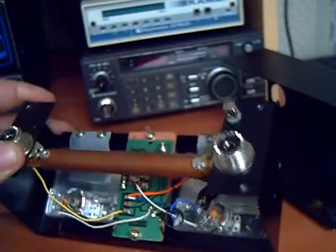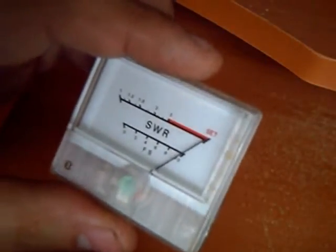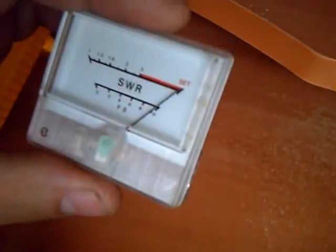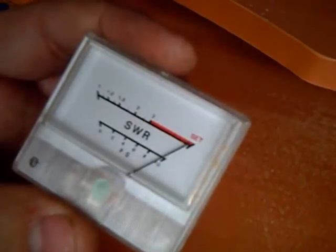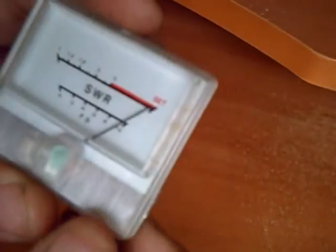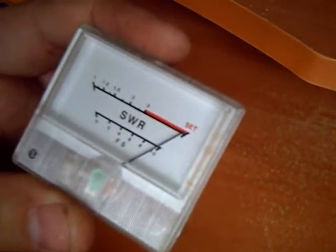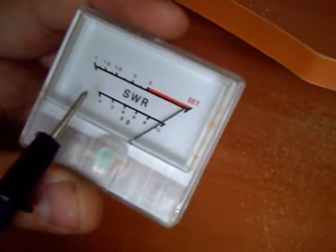It will give you relative field strength. Not much to it, but let's see if we can get this thing working. Here's the SWR meter again, taken out of the assembly. It's disconnected and set aside. I've used my probe and disconnected it from the circuit altogether. I think somebody actually sent too much RF energy through this meter and has pretty much destroyed it. The reason the meter seems not to be functioning properly is the spring that sets this needle back — I think the spring itself could be damaged.